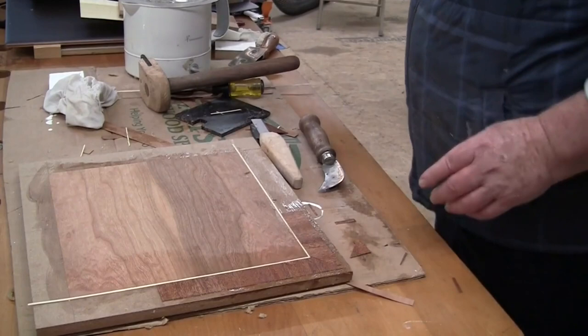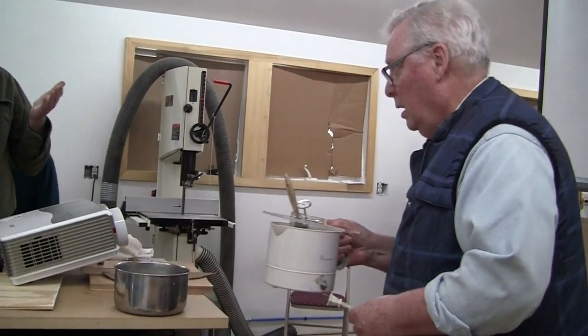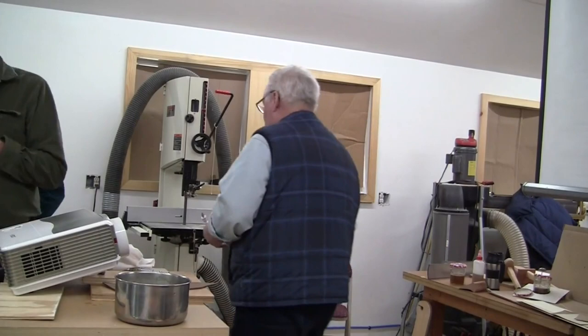Oh, nice. So, you were talking about sizing the ends of the MDF. Right. It just sucks up too much glue. Can you do that with your typical PVA and water mixture, size it, and then you might glue it? I guess you could, sure. I mean, the two should stick together.